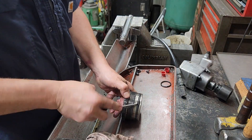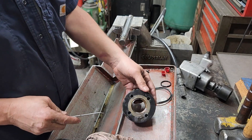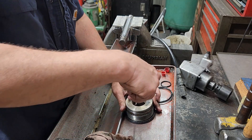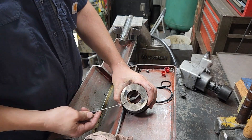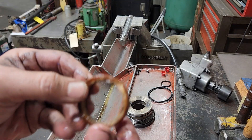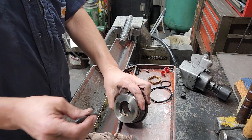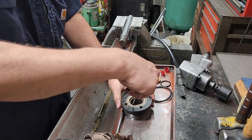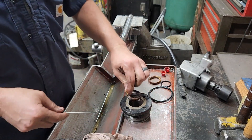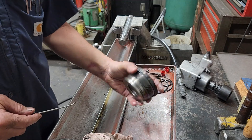Start with the gland - we'll remove the o-ring first, then the backup. And that's it externally. Now we'll remove the u-cup. Thing's brittle, and that was clearly the problem. And the wiper's gone - totally. We remove the wiper, and that's it for the head.